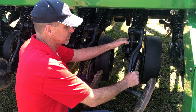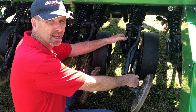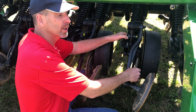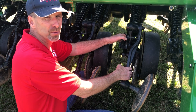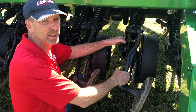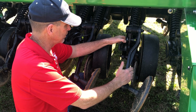The medium position is generally adequate for the firming wheel. If you are drilling in a conventionally tilled situation — where the soil has been plowed and disced and is really loose — it's probably a good idea to back the pressure off to the bottom notch on both the seed firming wheel and the closing wheel, so that you're not plowing up that soil behind your opener boot.